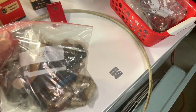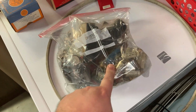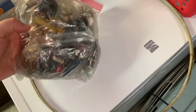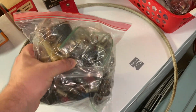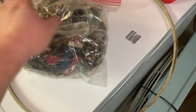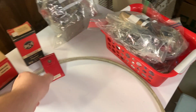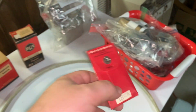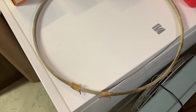Let's see, this bag here is everything else. You got your resistors, your paper caps, your, let's see, more paper caps, that bad wire wound resistor for the blue G2 control. Resistors I changed. It's a heavy bag. I am keeping all the components I changed in this set. The detector diode in the tuner, the field neutralization coil.